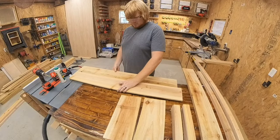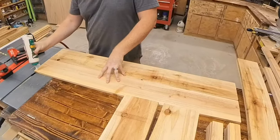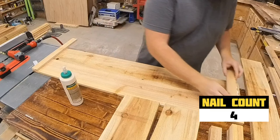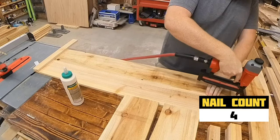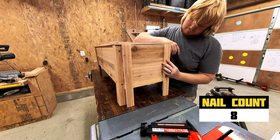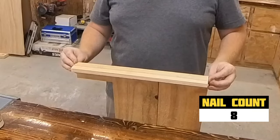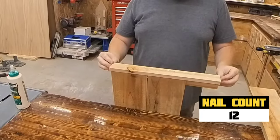Grab two of the long pieces and make sure the good side is facing up — this is going to be the outside of the box. I am using Titebond III Ultimate, a waterproof exterior glue that isn't as thick as other glues. Squirt a line of glue and align the leg with the end cuts of the long boards. Fire in four nails and repeat the process. Starting with the long sides means the sides and bottom can be cut to the same size, and gives the shorter side more surface area because the legs are farther apart. I also apply glue all the way down the leg so they do not separate later on. The leg edges are flush on the interior, creating a lip to cover the edges of the short sides. Three nails hold it in place — the nails are mainly there to hold the boards together while the glue dries.